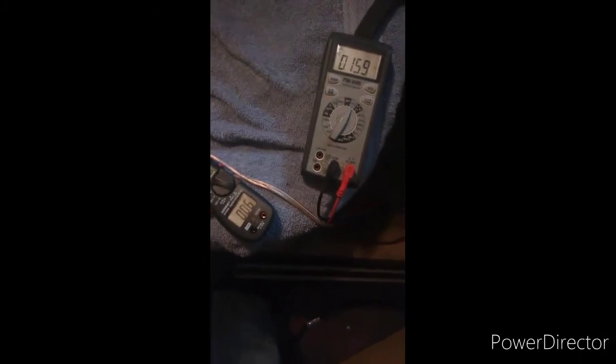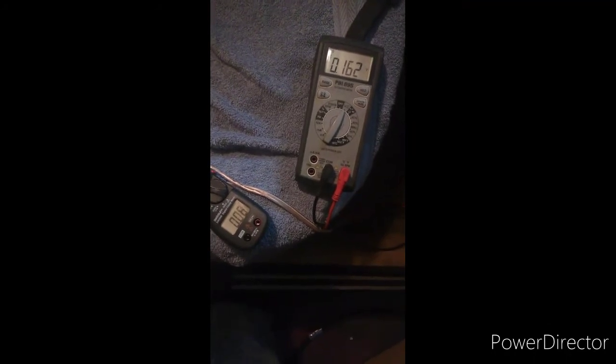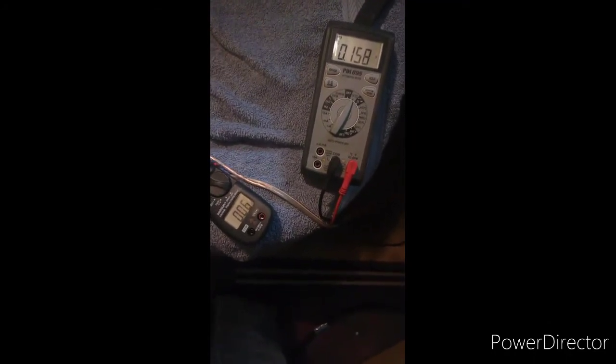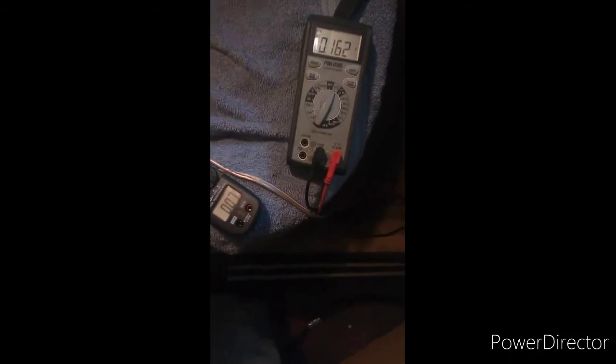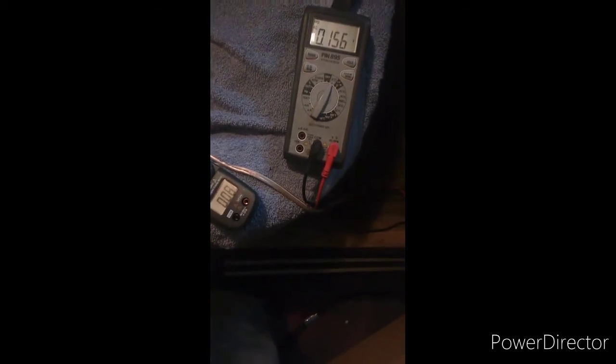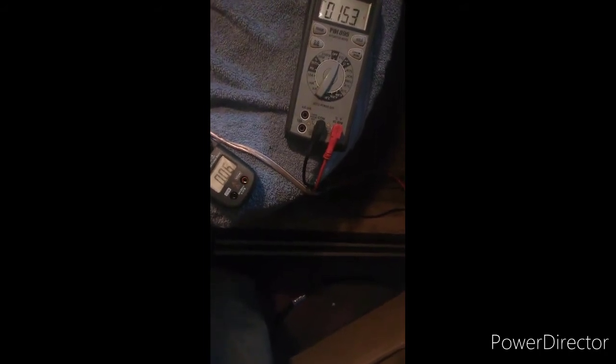a power test. Now there's four things according to Ohm's law. You need two out of four factors to measure wattage or power output, including the watts itself, which is one of the four. But you have your voltage, AC voltage, which carries the sound signal from your amp. You have ohms, which is the resistance of your speaker itself or whatever load you're running to. You have your amperage, your current draw. Now, you could use two out of three of those to measure your wattage, the fourth factor being wattage.